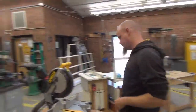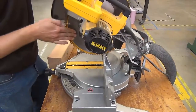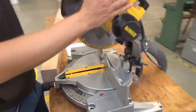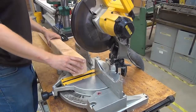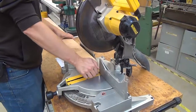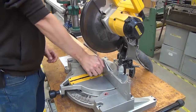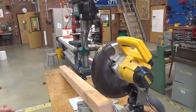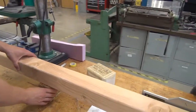Brian, why don't you come over on this side of me here. The way this tool operates is a spinning blade that drives the material down and against this table as it gets cut. So when we set up the wood, it's important that this material is against this table and against these back tables as well. Now that's really hard to do with this heavy 4x4, so anytime you do something long, we've got a couple of supports that you can put under the material.